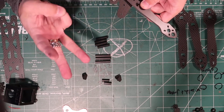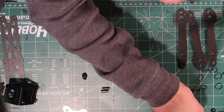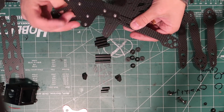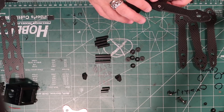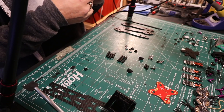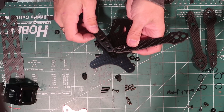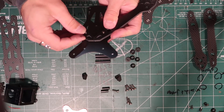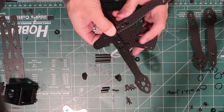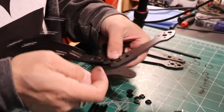You'll notice there are three different sized standoffs, and the frame is on the ground — we'll explain that later. These cone washers will be used because you do have to wrench down the bolts that go into the press fit nuts pretty tight. There are two sized nuts: a shorter one and a longer one. The longer one goes on the inside. The arms lock into place internally underneath the back plate, and when they go in correctly the arms all lock into place.